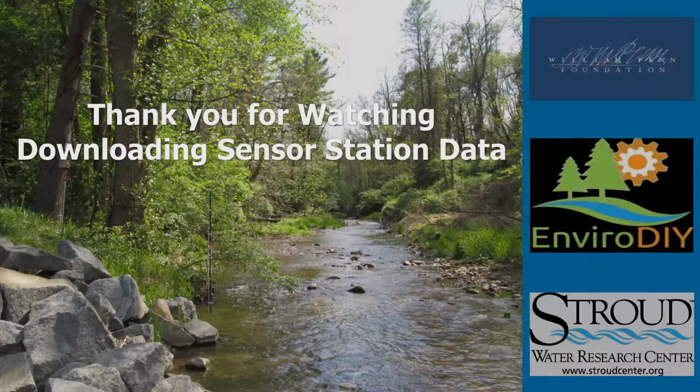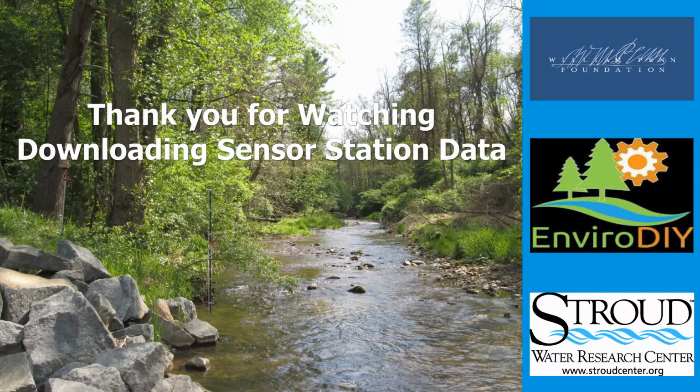This concludes the process on how to download data from your sensor station via in-field SD card collecting. As mentioned before, this should be done for all stations, even those that stream online, on a quarterly basis at least. I also suggest that you take the time to convert your SD card data over to an Excel workbook format with a visual graph inside. This can be done right after you complete this process.